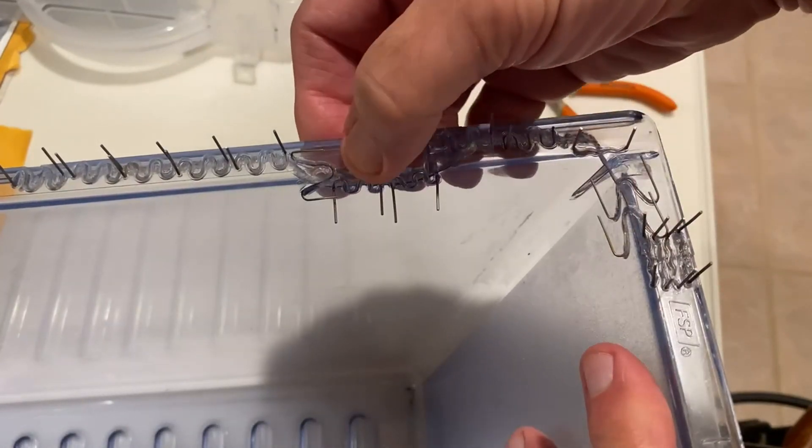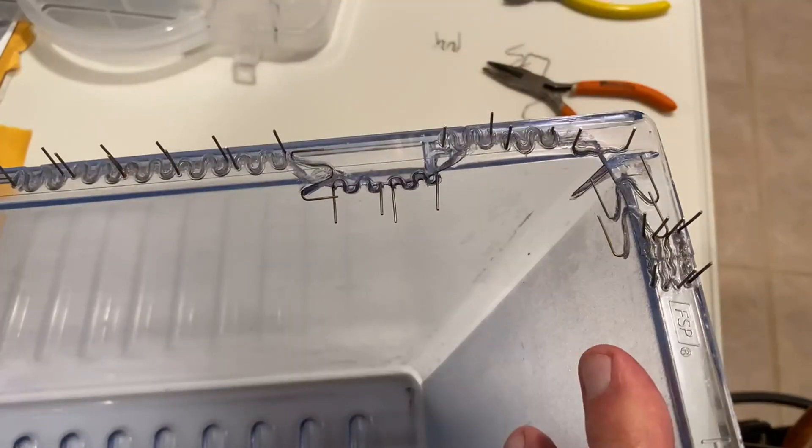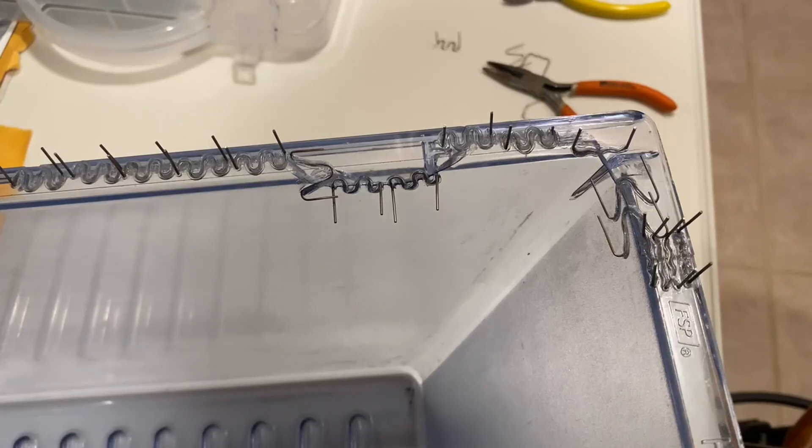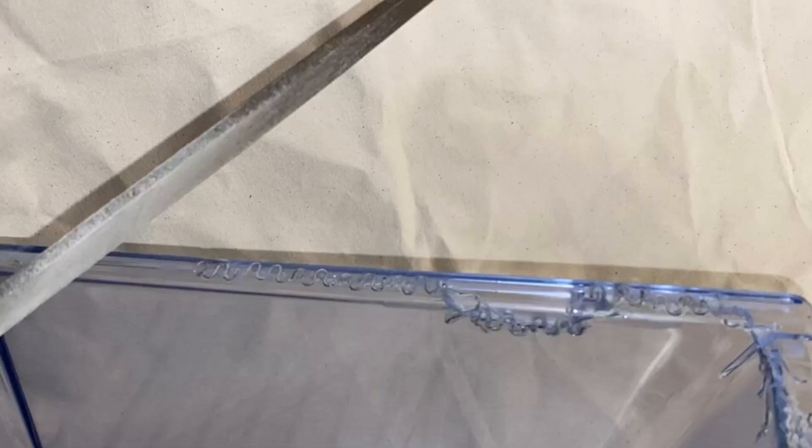Turned out really strong. I was going to solvent weld it but I decided not to. Not all the tails snap off as intended, so then you have to use the cutters, and that leaves a nasty sharp bit standing proud, so I use a rotary tool with a grinder to take it down just slightly below the surface so it won't snag anything. I had intended to wet sand it through several grit stages and then polish it, but in the end I wound up just using a flat mill bastard file to take the mushed up plastic down flush and it turned out fine for the intended use. It doesn't show — it's at the back of the drawer. It came out very nice.